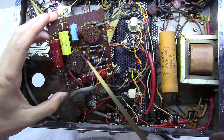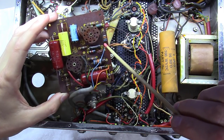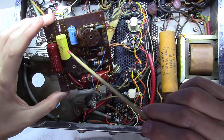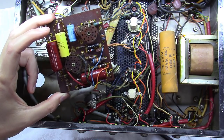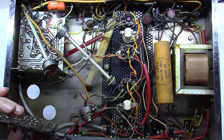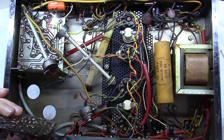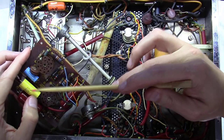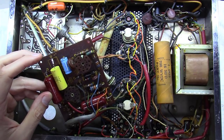When you've gone to the effort of pulling this out, go ahead and spend the five or ten dollars to replace everything — so this unit will last another 50 years. Replacing just one component, you're just waiting for the next one to die a year or two later. By the way, they used a 2-microfarad cap and I'm betting it's not the right value. To back up: I bought this amp on eBay, the seller sent lots of pictures of the outside but none of the inside, and said it had just been fully restored by a professional tech — I'm seeing that's not the case.